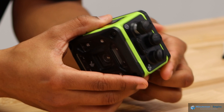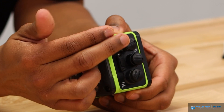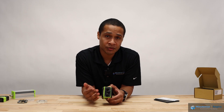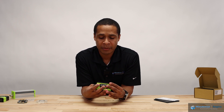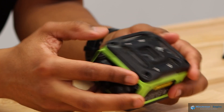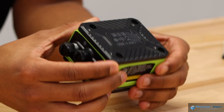This last port is our IO port. We can supply 10 to 30 volts DC and have nine programmable pins. I can set some of those pins up to be inputs and some to be outputs — depending on your application, it's very flexible. On the back side, we have four mounting holes — two on one side and two on the other — giving you a good range of mounting options.